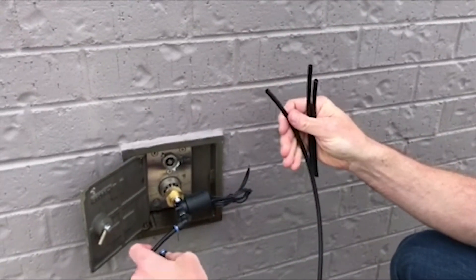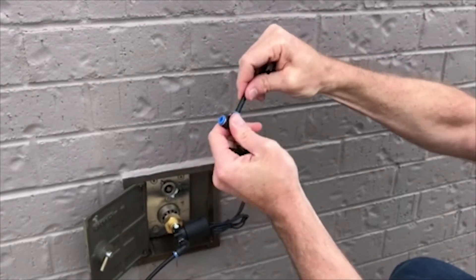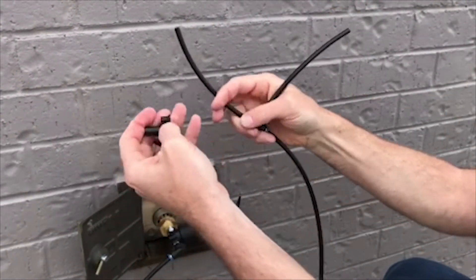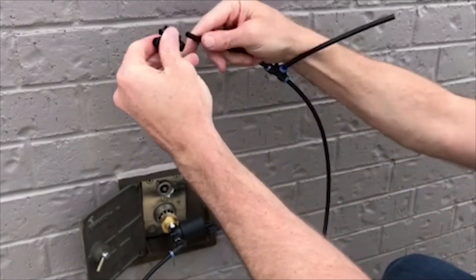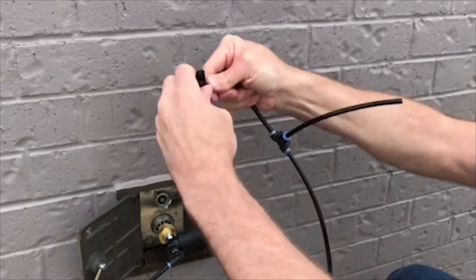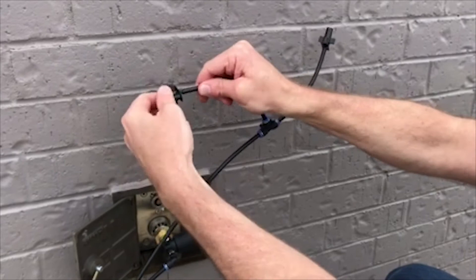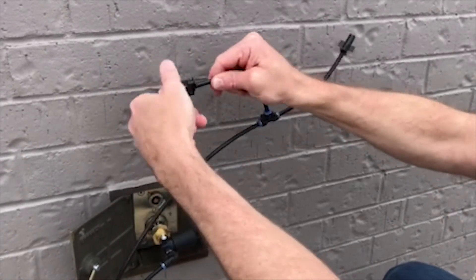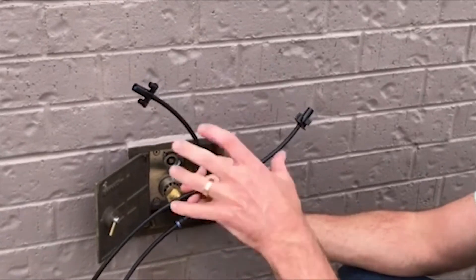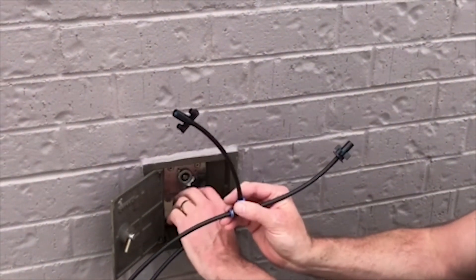This is the end of the line coming from the smart AC valve. We're going to go into the tee, then I have two short pieces coming out to configure this and hook the foggers to the ends. You just push and thread those in all the way — same thing on this one — push and thread all the way until it's done.